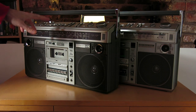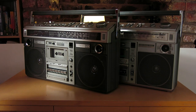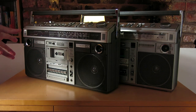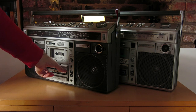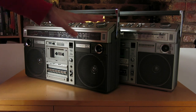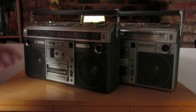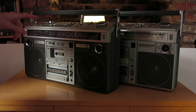These 8190s use five belts in the tape mechanism. The tape mechanism in the 8290 is slightly revised and it only uses four belts. There's actually quite a bit of revision between the two decks, even though they look fairly similar. You've got more buttons on the front of the 8190, because it has separate stop and eject controls. The decks were revised, most likely due to manufacturing cost. They meet the same spec and they're the same quality, but they were simplified for manufacture in the 82.